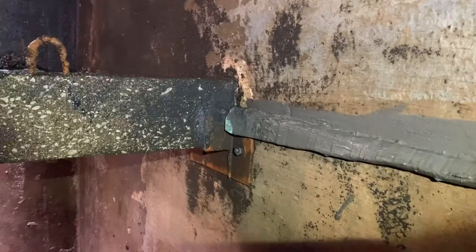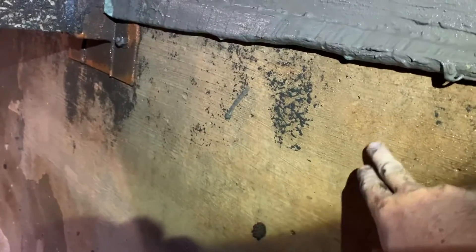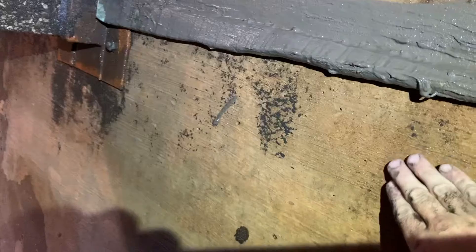We did pressure wash the walls of the tank, but another inspection point is knowing what kind of tank you have. Concrete tanks — if it's one of our concrete tanks — don't need to be sealed. But this one had what's called Thoroseal or Master Seal 581 to waterproof it. When pressure washing, you want to make sure you're not washing off the sealant, so do it on a low setting — just rinse the tank and give it a chlorine rinse, which is what we did here. This tank could stand to be sealed again; you can see how much has flaked off over time.